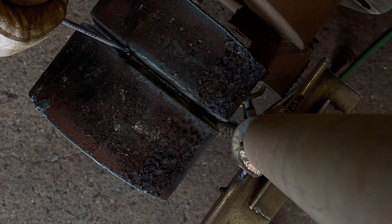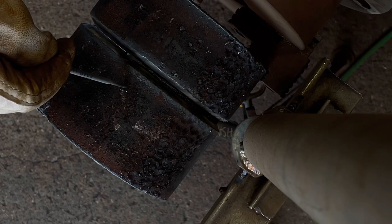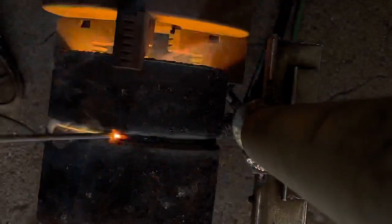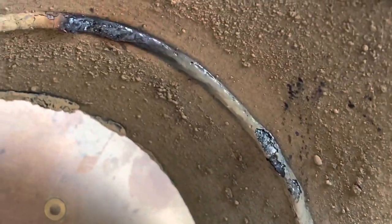This is your canvas, guys — inside of that bevel. Outside of that bevel is restricted space. No one's allowed here — no striking an arc, no grinding, none of that. Nothing outside of that pipe. I needed a little bit more amperage there — I was fighting it around that area, pushing my rod in too much. You really don't want to fight it, but hopefully you guys caught that. That's how you do it. The technique I use for the 6010 bead is simply keep it around that angle going all the way around the pipe.